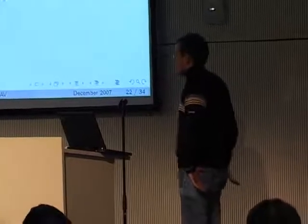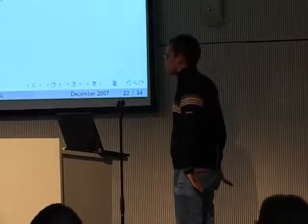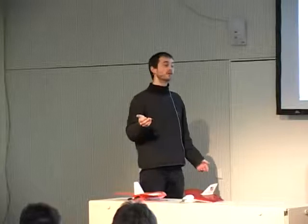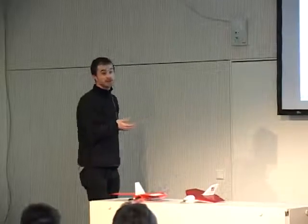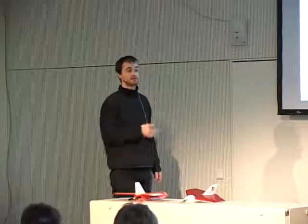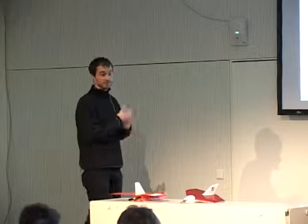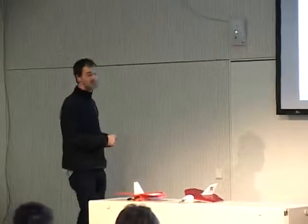What you usually find in other autopilots is that they don't have a real language to define their flight plan. Mostly you define a couple of points, or in unsophisticated ones, maybe circles. Here you have a complete language to write your flight plan just as a program. So if you want to write a flight plan that does the complicated thing we showed before to mimic the biological behavior, you can write that. This is a Turing complete language, so whatever you can write, you can write in this language.